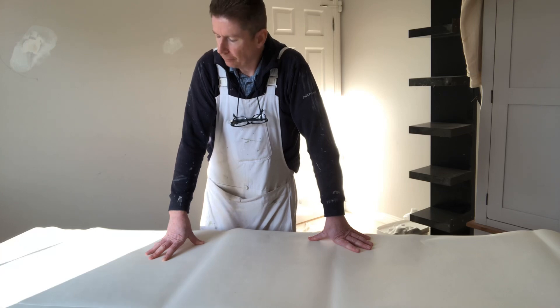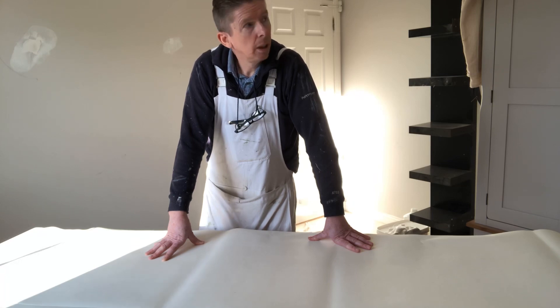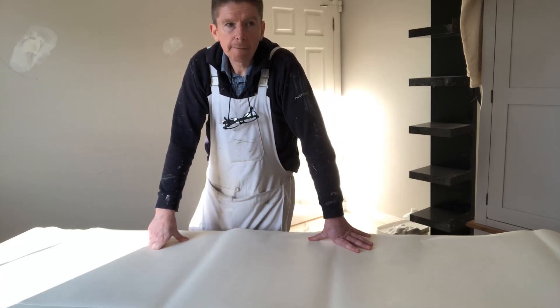I've got 144 inches in length and basically ready to paste and go on the wall. The only thing I have to do now is size the wall — basically straightforward, just cut it in with a brush, as if you're painting, just cut it with paste and leave it to dry and it's ready to go. So that's this wall ready, and I'll do another video on hanging a few strips to give you an idea on how to do that. Again, thanks very much for watching. If anybody has any questions on how to go about preparing the wall, doing the measurements for the lining paper, or what tools you need, you can ask any questions. Thanks for watching.